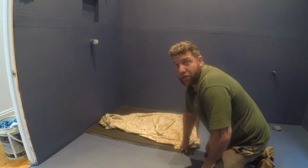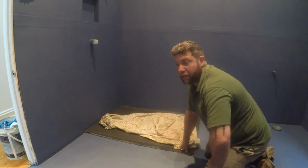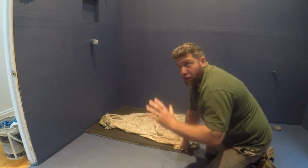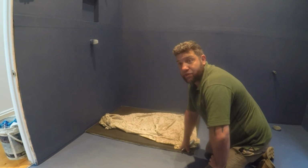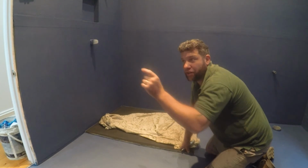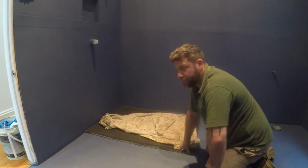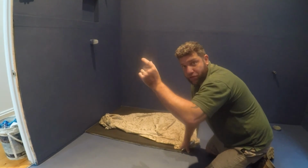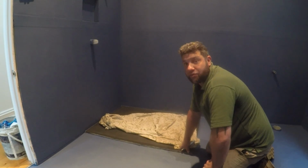These walls in here are 130 years old. They will be out of plumb, so out of level that way. So what we've got to do is try and get those to be adjusted the best we can to get the best end result. So they don't stand out too much and you don't have a joint of 25, 30 mil at the top to nothing down the bottom. We want to try and reduce that, or what's called an inch, to nothing down the bottom. So what we want to do is make sure that all blends in really well.